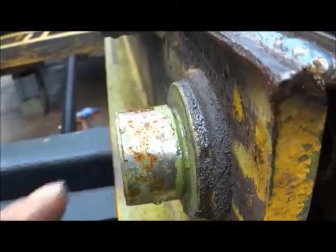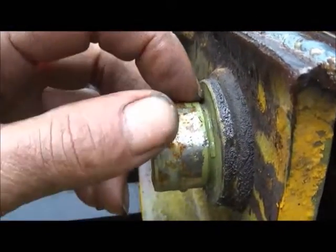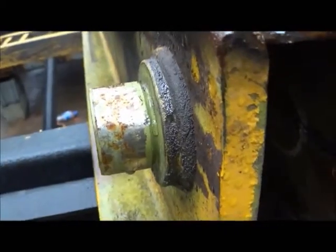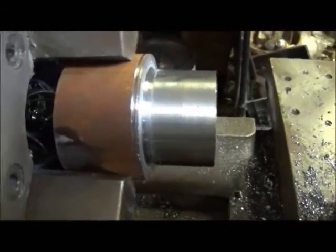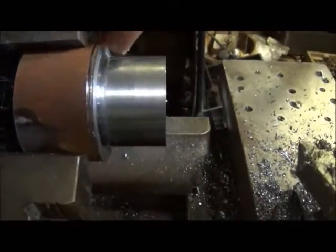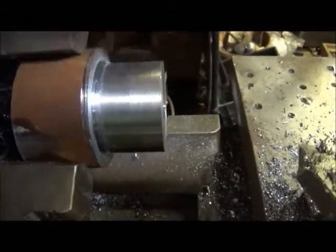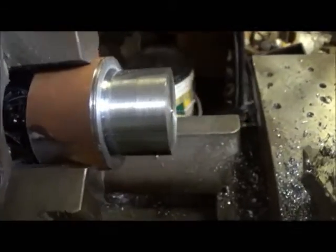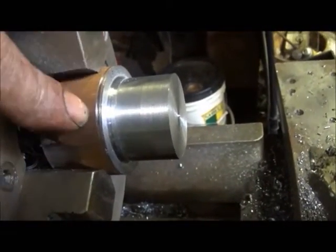So that keeps you from having a sharp edge, because the bearing's got some taper on it, but I know my plate don't have any taper on it. I could have put some on it, but I'll show you what we've got on the machine here. I don't know if you'll be able to see it or not, but what I done is basically the same thing. I didn't quite go as deep as they went, but it's rounded out, and that way we don't have any sharp corners. It's all radius.